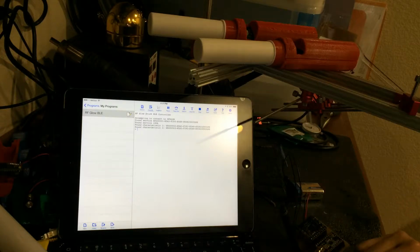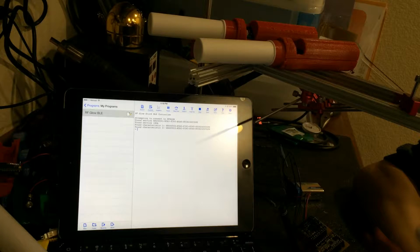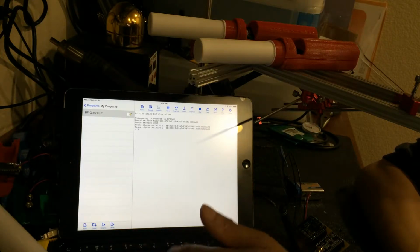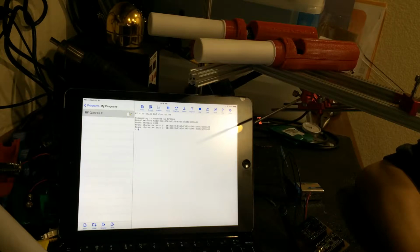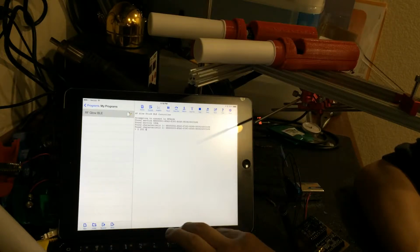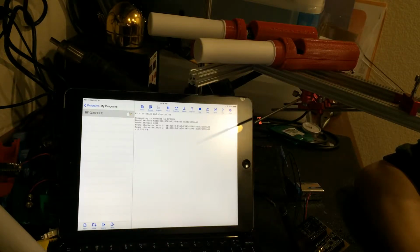Currently this is a console, standard in, standard out based application, but TechBasic is capable of GUIs, and so I could tie these sending commands into the GUI event handlers. The interface here is very similar to the serial interface I wrote, since this is just for development purposes. You enter in a 3 digit hue value, on a 0 to 360 or 359 degree scale. 0 is red. The saturation is from 0 to 255, and the brightness is also 0 to 255. I'll hit 40 here.